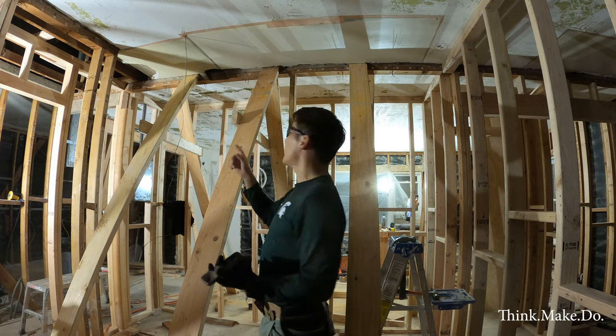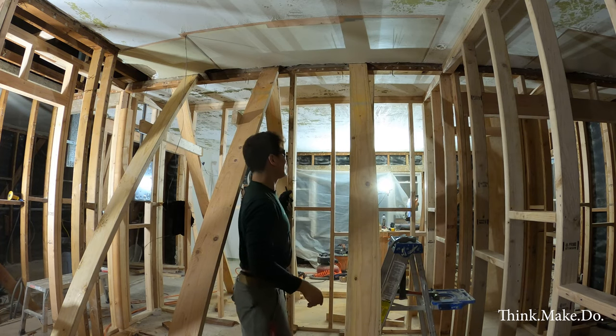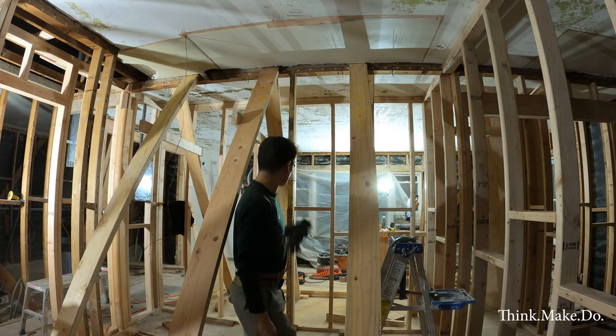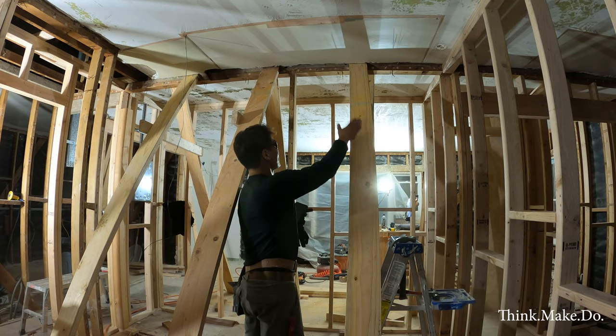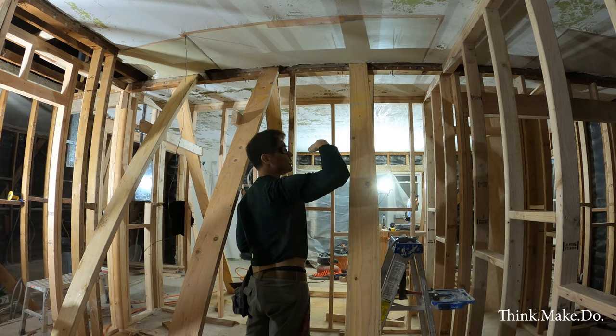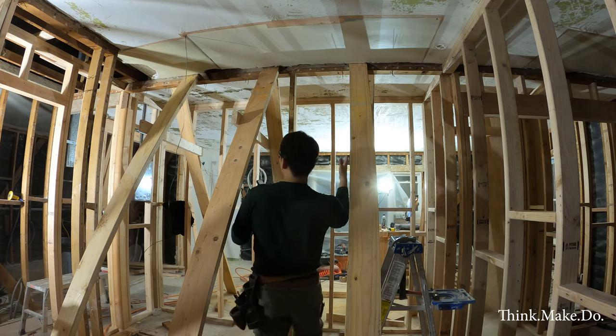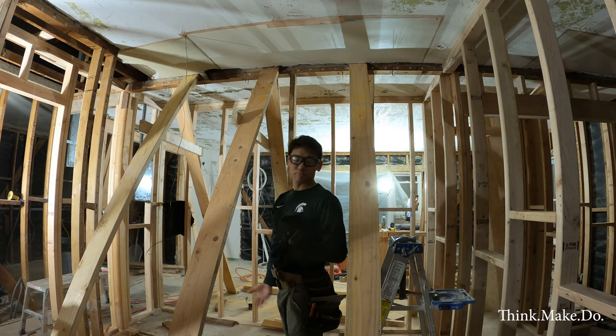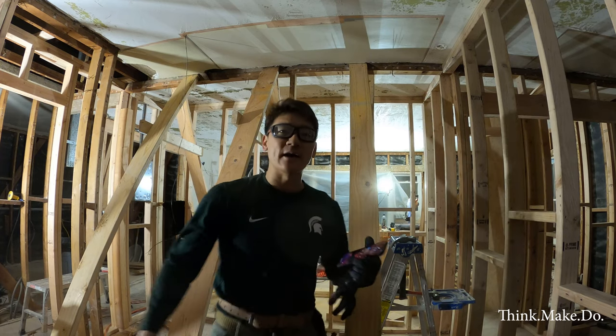And then once I'm done with that, this last stud comes down, well actually, this 4x4 post gets prepared. This last stud comes down, I put this last A bracing on, and then I bring my 4x8 header up, and I install it. Let's try that out.